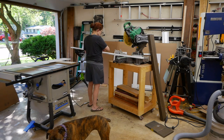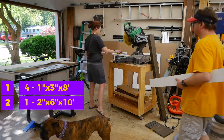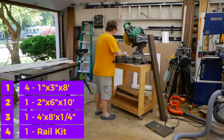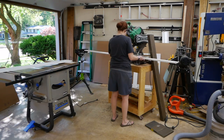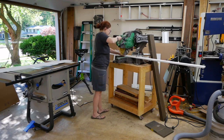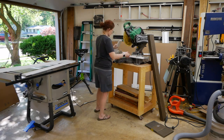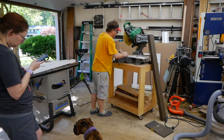To start this build you will need four 1x3x8 foot long boards, one 2x6x10 foot board, one 4x8 sheet of Luon or plywood — this is a quarter of an inch thick — and one rail kit. You will also need some miscellaneous screws for the assembly. Size the kit for your opening. For us, our opening was 48 inches and required one main kit and one extension rail. Likewise, the length of the 2x6 will be dependent on the size of your opening as well. I will leave links in the description below for all the parts we used.